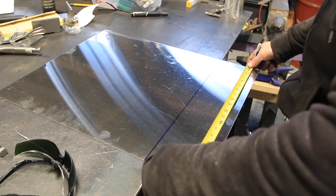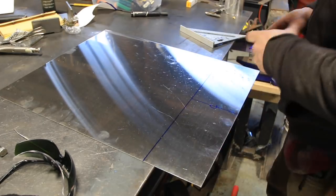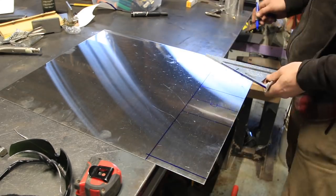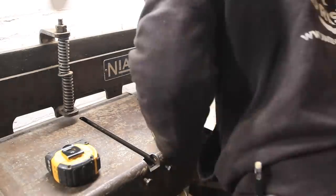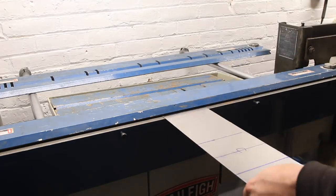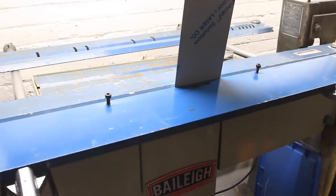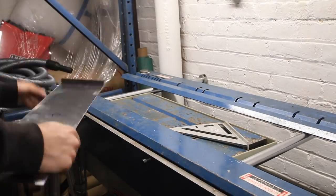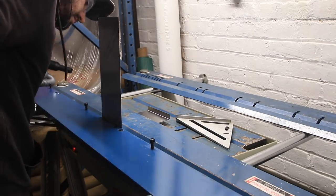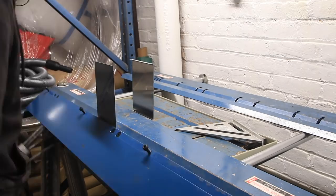I decided to use a little bit more of the stainless to make a little stand. I see a lot of these coffee drippers have a square stand that the coffee can drip through so you don't have to put it on top of your mug directly. So I marked this out with a tape measure, went over to the jump shear and just sheared off a piece. The other lines I put in there are going to be useful for the bending. This is a Bailey mag brake — it uses electromagnetic force to clamp the presser bar on the top, then it's kind of like a traditional bending brake where you've got a leaf that flips up. What's really nice is the presser bar is so small that you can basically wrap things around it, making it really versatile. You can do things you wouldn't normally be able to do with a standard finger brake or a straight brake.